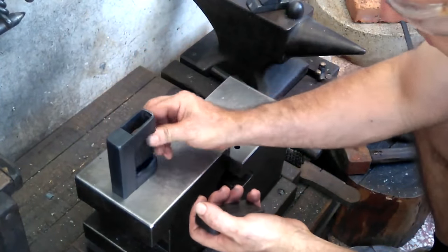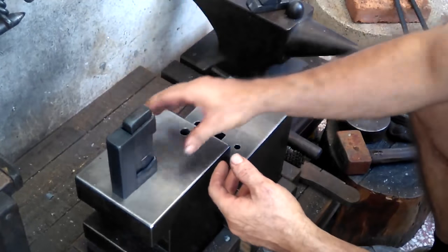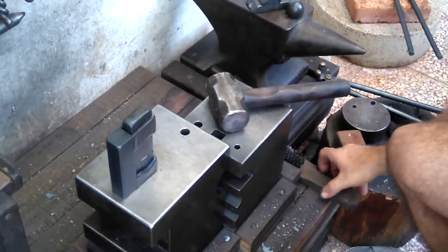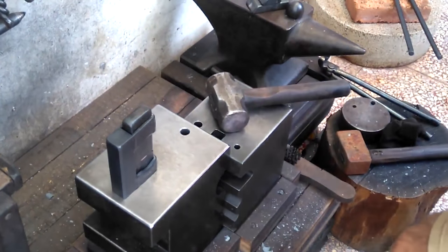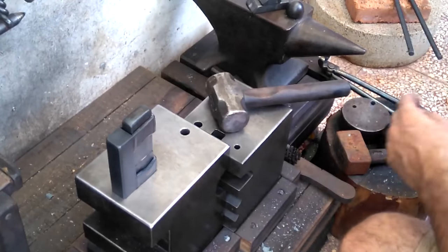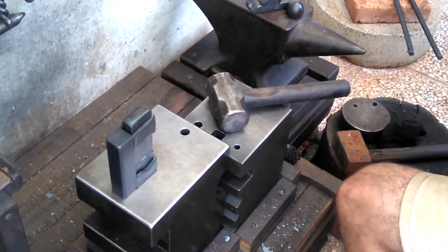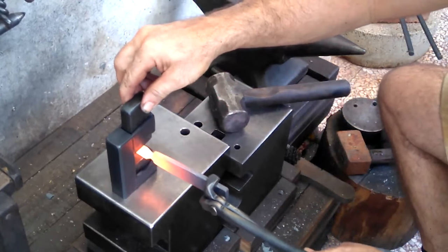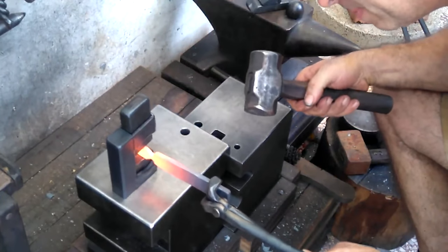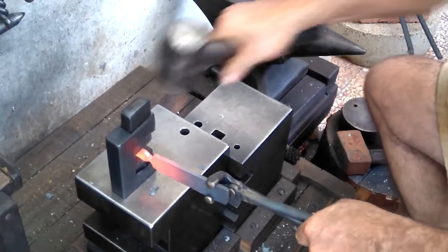I'm switching to flat dies. I'm gonna leave that area that I fullered as a spot where I can put my mark, and where I'm gonna use these flat dies would be where the actual tang will begin. Don't ask me why, I'm not a blade maker. In this instance I just wanted to show you guys the guillotine tool and also the tong. You can see here, I'm just going back a little more and then starting the actual tang there. You'll get the idea.